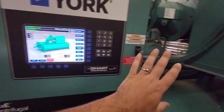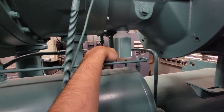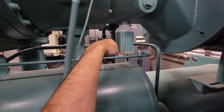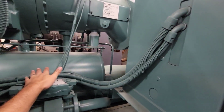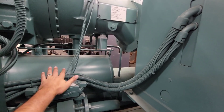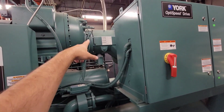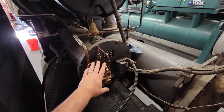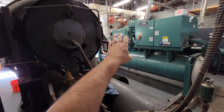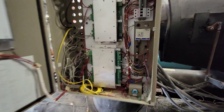This York is doing really well - we've had a lot of success with it here. The customer has had to get acquainted to running at a little different parameters, so that's been a training adjustment. This canister hasn't been emptied - this chiller's been running for at least six months - and that's perfectly fine. That little bit is your oil catch for your shaft seal; that seal will seep a little oil over time, so I'm not worried about it. After I do that filter I'll get this one booted up. On this chiller we've had to replace and rebuild the oil regulator assembly, and it also had issues with oil filters stopped up a couple of times, so we had to replace all the oil on this one too due to age and breakdown.